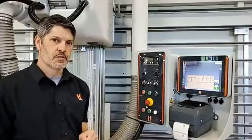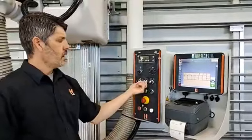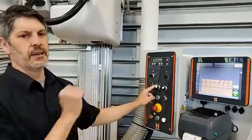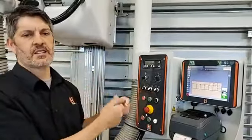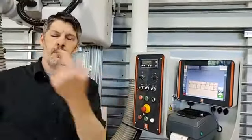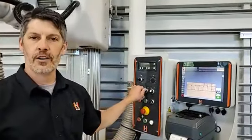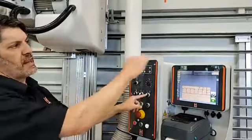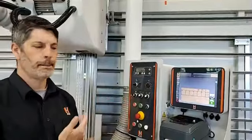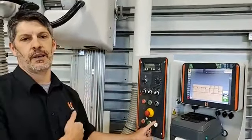You have a key safety switch so only the operator can put it into automatic. These are the cycle switches — this is what made it pause at the end of the cut. If I have it in this area, after it makes a cut it's going to return. Let's say my trim strip is not so critical — I can get it off very quickly and meet the saw back at the other end. For other parts I might need some time and not be rushed to get them off onto my table. So I would use the pause. In horizontal, if you're cutting a small part, the other switch means it only uses half the frame, not the full cycle — saves some time. Start and stop for the automatic, return, start and stop for the blade, and to lock it in place vertically or horizontally.